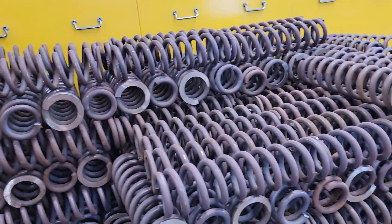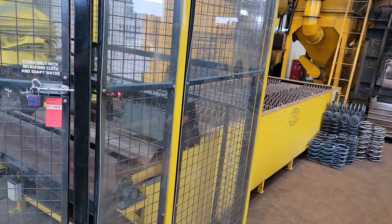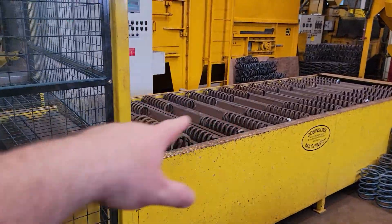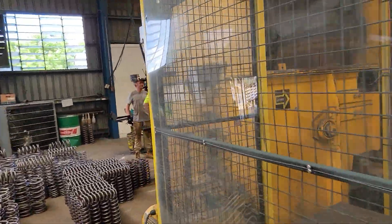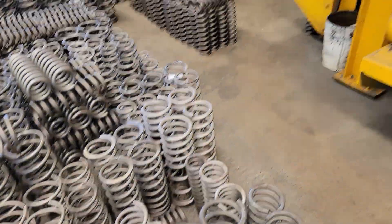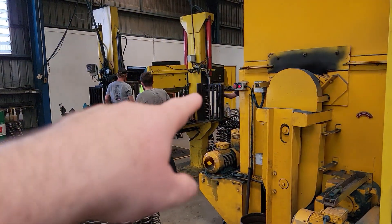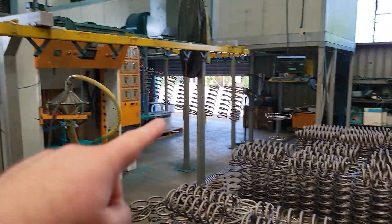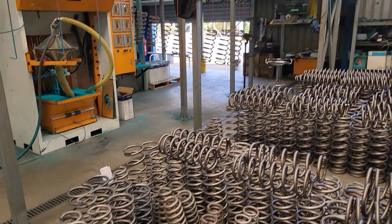Now these will sit here until that color is ready to powder coat. They'll get fed onto this line right here — the robot will pick them up and put them in the shot peening machine. The shot peening machine shoots at them from all angles and cleans it up. So it goes from formed and ground, set on there, shot peening, scragged, checked, ready for powder coat, then powder coat. The powder coat line goes all the way up and then through the oven — pretty tight system.